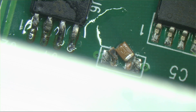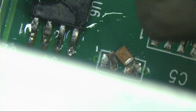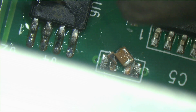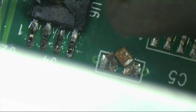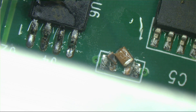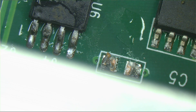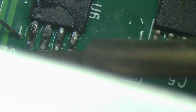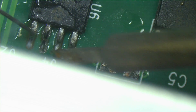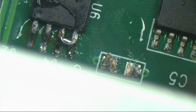I'm lowering the temperature to 335 — a temperature where I'd expect nothing to come off the board with any Apple product, but you'll see it's gonna melt this IC almost instantly into place. I'm hoping the IC is not itself damaged. The legs on this IC look like shit; they're not even at all.